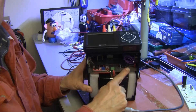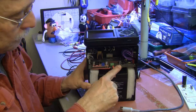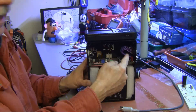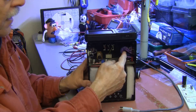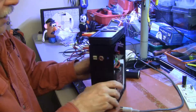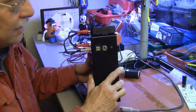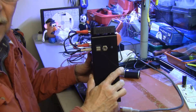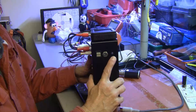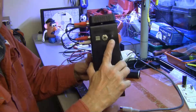The front circuit over here on this side, which is probably hard to see, is the microphone preamplifier, and behind it is the 60-cycle reference. There's a plethora of connectors on this side — there's a charging connector on this side and the pilot light. I'm rather proud of the pilot light. I don't have any rectangular drill bits and this is a nice rectangular blue LED, so what I did was drill a hole that was the right diameter to hold the wide direction of the LED and then back-filled it with hot glue.